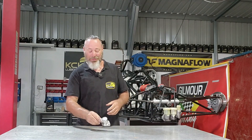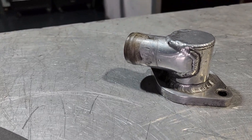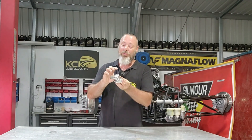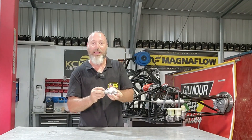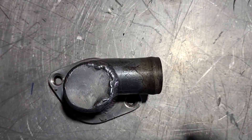I thought it was pretty cool when I went through the box of parts and found one of the thermostat housings we'd actually made back in the day — it was still fitted to the car. We mucked around a lot with these — tried them with thermostats, without thermostats, different temperature thermostats, different heights of the head. We also found that on the orientation where the radiator hose goes on, if we swirled the flow around it would help separate the air bubbles from the coolant, which then goes off to the header tank to separate properly. Didn't necessarily find any massive power gains, but we felt we made the cooling system that little bit more efficient, predictable, and long-term it was a much better thing. So we're going to fit this OG thermostat housing and then get the flexible pipe on between this, the header tank, and that last crossover pipe.